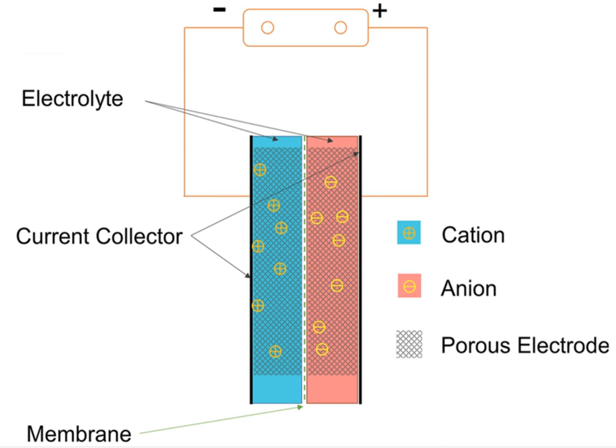As a result, double-layer capacitors have much higher capacitance values than conventional capacitors, arising from the extremely large surface area of activated carbon electrodes and the extremely thin double-layer distance on the order of a few angstroms (0.3 to 0.8 nanometers) of order of the Debye length. The main drawback of carbon electrodes of double-layer SCs is small values of quantum capacitance which act in series with capacitance of ionic space charge. Therefore, further increase of density of capacitance in SCs can be connected with increasing of quantum capacitance of carbon electrode